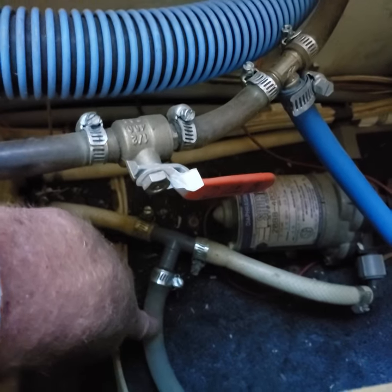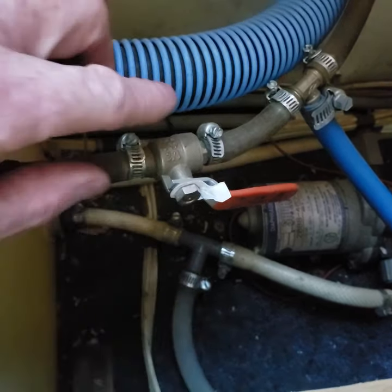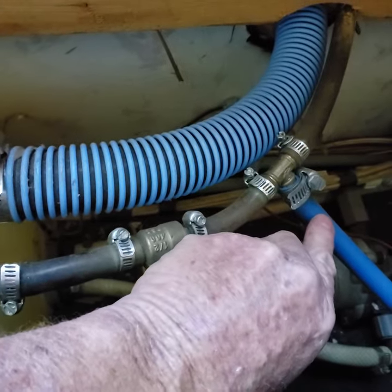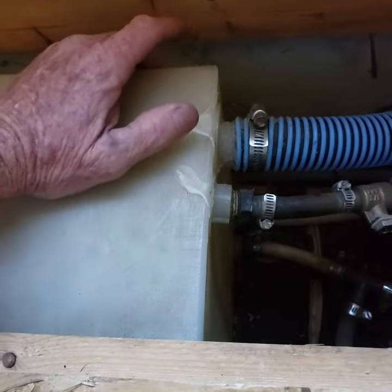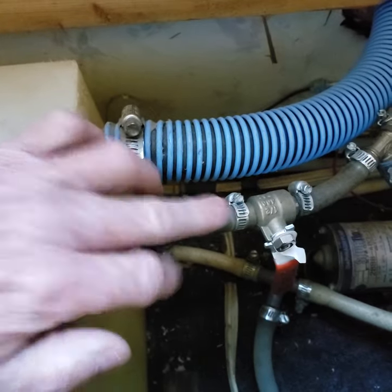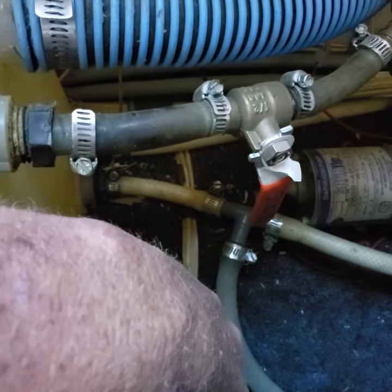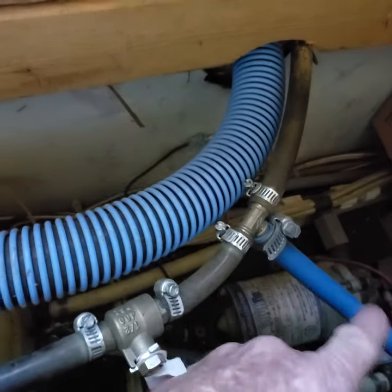I tapped into it and added this line to the new water tank so water could come from the original tank into the new one. Then I ran up to the air line that lets the air out and added a valve. When this tank gets about 80-90% full, I can turn the valve and shut the air lock so the air can't get out — the pressurized water then has to go through the T and fill the other tank. When it fills the other tank, this return air vent line lets you see that they're both full.